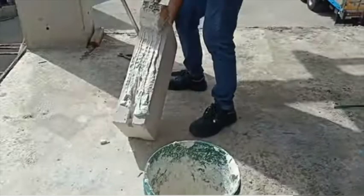The reason they don't work, in my opinion, comes down to the foreman, the owner, etc., who sees the use of this shovel and then sees a lot of adhesive just splattering onto the ground. Because again, recall from the previous video, it's very soupy, as it were. Imagine what gravity is doing when you turn the shovel upside down to apply it to the bottom of the AAC block. So again, they're just not using adhesive correctly.